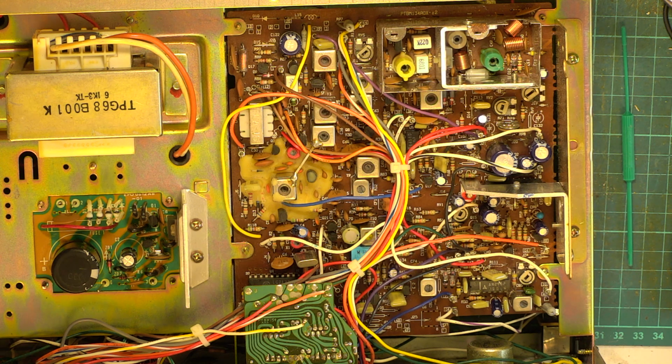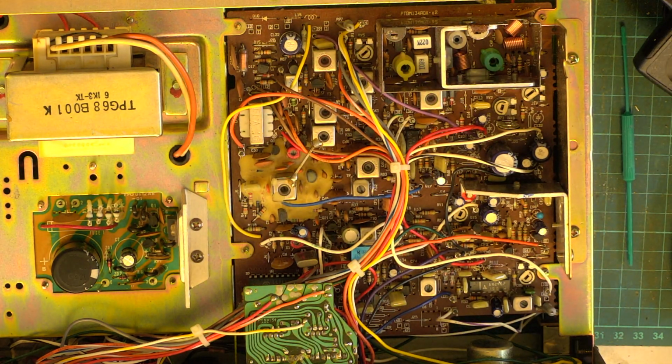Receive. I'll just check I'm still on frequency. I am. So we're going to go over to this. The first thing we're going to do is a detector. Turn the bench light off. Put an S9 equivalent signal on, which is 100 microvolts.